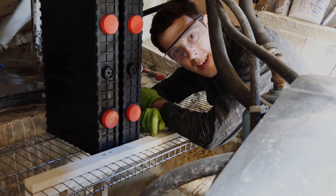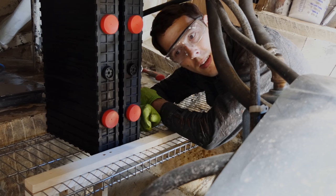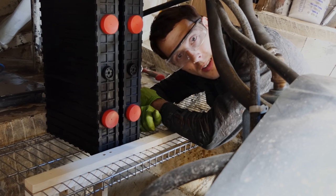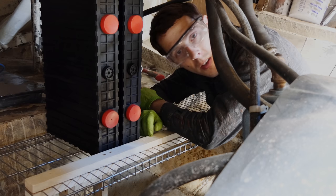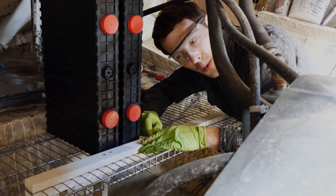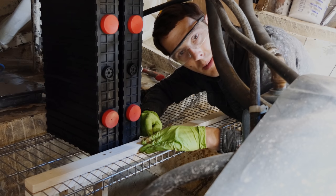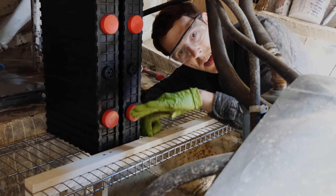Of course, all the wood here is going to get soaked up in epoxy and sealed up nice. And then the 3M 4200 sealant will be a strong but removable sealant and adhesive to stick this down onto the boat. So really, it doesn't need to handle very many forces. I just don't want it bouncing up and down.